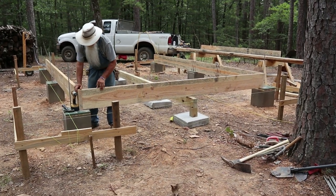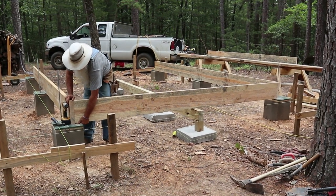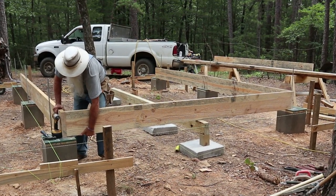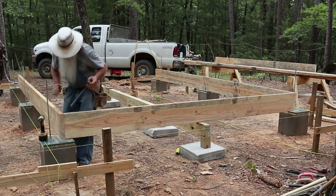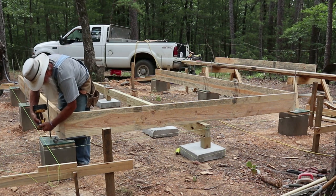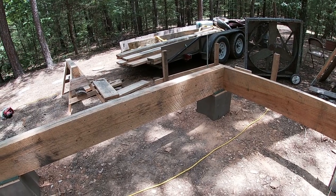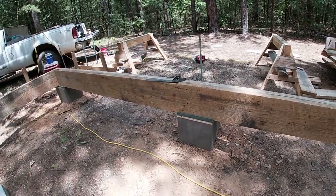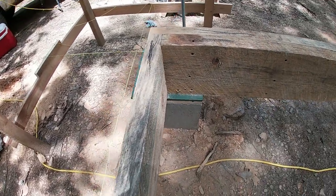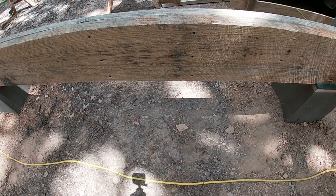I had to hold this one up just a little bit because it's just a little bit less than ten inches, so I'll go ahead and anchor it into this board here and I can put some shims underneath that to carry the weight. I have the inside piece of the beam put in and it's screwed to the outside piece — I cut that to go between the outside joists and I screwed it into the end of it also.